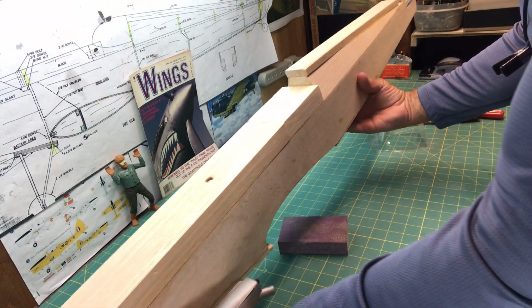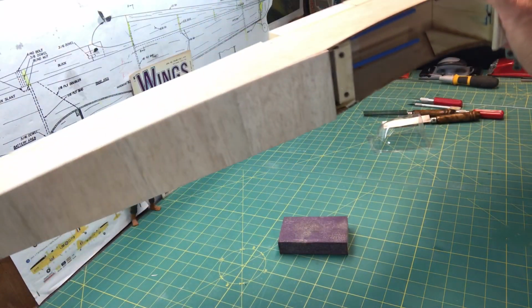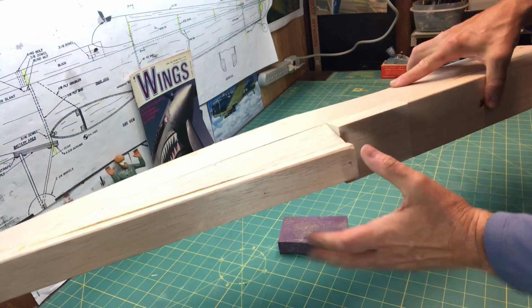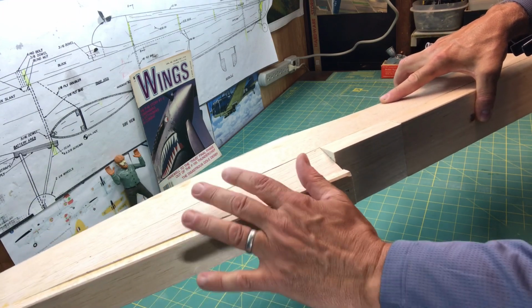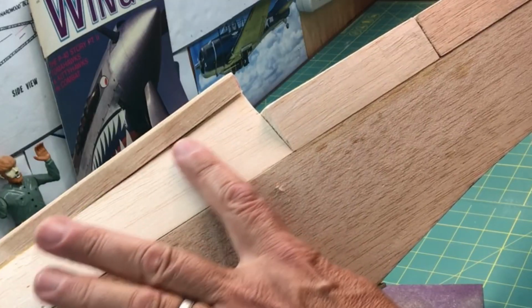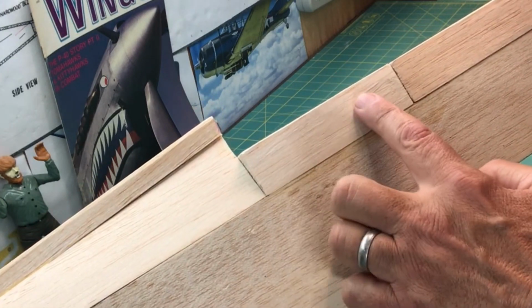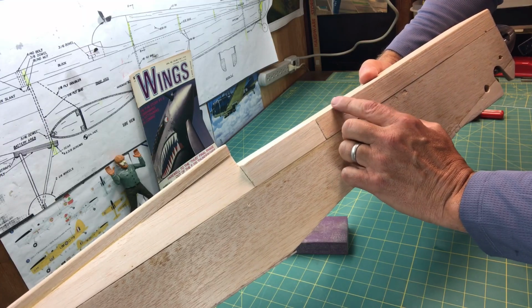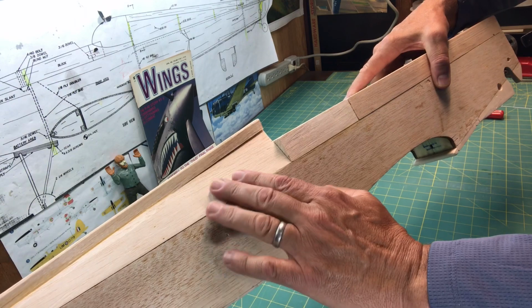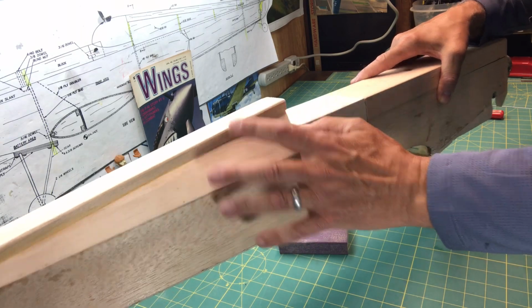And then as we get to the back, the other control area, let me flip it around, is going to be this flat surface of the turtle deck in here, which is set to where it is. You're not going to be able to sand too much of this. That's basically the way the shape is. So this flat panel shape is going to be carried across this cockpit area and then blended into this upper block here on the nose, this hatch. And then the same shape is going to be extended upward to this top block, and then this is just going to be rounded off.